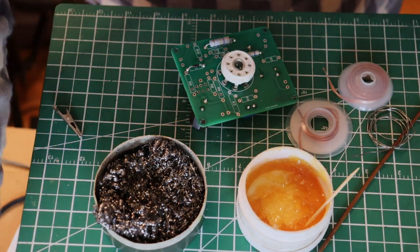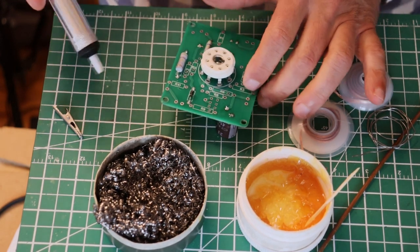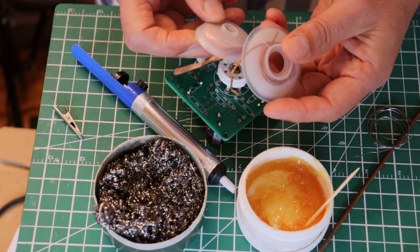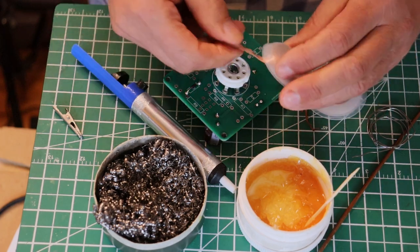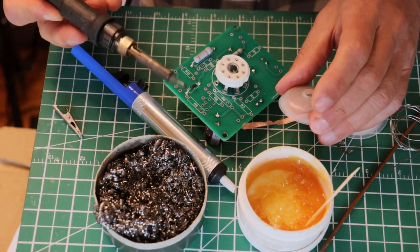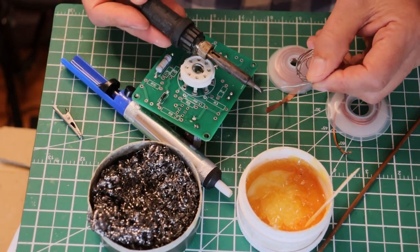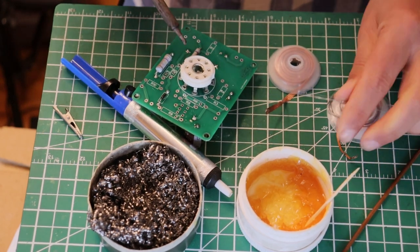You might have to come in a couple of times with the pump to get the last little bits. The pump is great for getting large chunks off, but what about the last little bits? That's where a solder wicking tape is really brilliant - it's just a copper braid. Believe it or not, it won't work well unless it's got some solder on it. Just put a little solder on the tip and get a little bit of solder going on your wick.